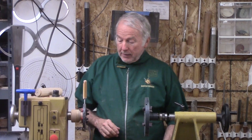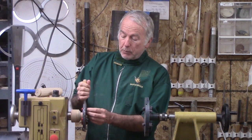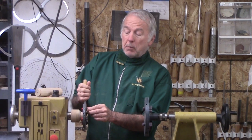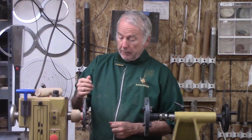Here we are at the Longworth. I added tommy bar holes and some grab holes. The tommy bar holes are the most significant because they allowed me to handle it with one hand. The platforms are oval with a ledge so that when it twists against the wood, it binds and does not keep spinning. It does not then require another tool. I found it easier to put it on the faceplate and then mount the wood. So that is enough for the chuck.